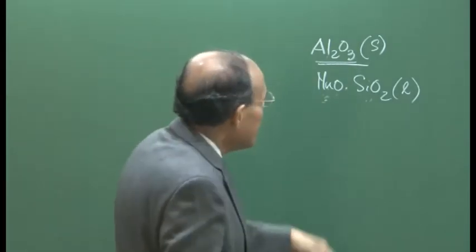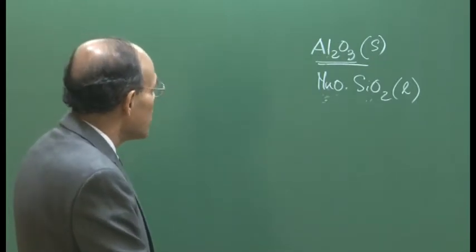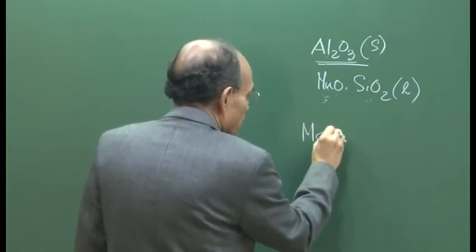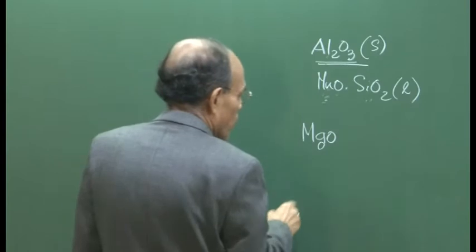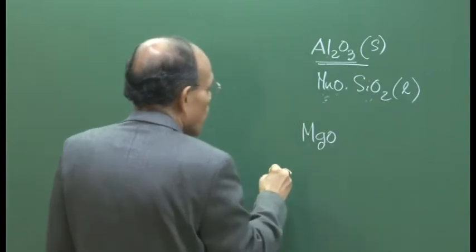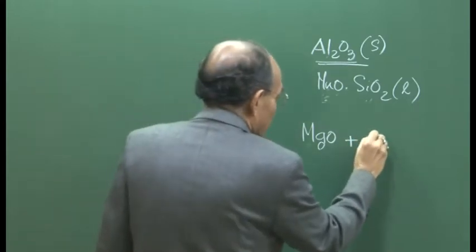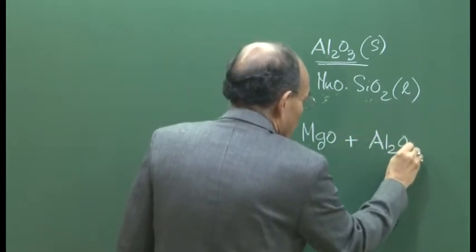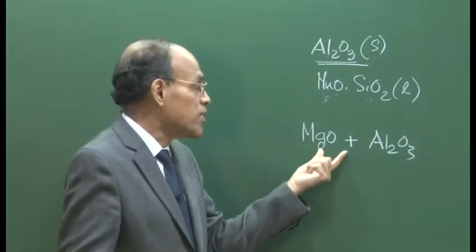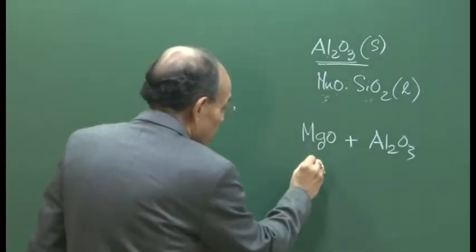Now, there are various types of inclusions which are possible. I just want to give you a brief account for the next 10 minutes or so. For example, you can have refractory dissolution, MgO. Oxygen is from the metal, and Mg is there from the refractory magnesium dissolution, and MgO is also present in the refractories. Then if we have alumina, we have magnesium aluminate, for example. These are called spinel kind of an oxide, double oxides actually, double oxides of alumina. Okay, this is one kind of possibility.